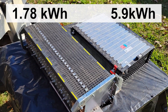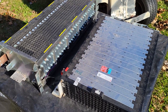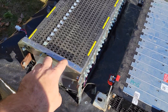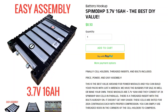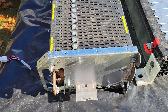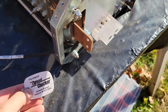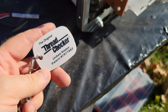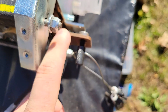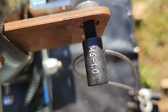Here's the two sitting next to each other — as you can see the Chevy Bolt battery is far more energy dense, but this one is capable of way more amps, just a crazy amount of amps. That's why these are so popular for e-bikes, because you can really push without worrying about overheating the cells. When I need to find out a thread I use this thread checker — I'll leave a link in the description below. On the positive post this threaded in pretty nicely, so that's an M6 by 1.